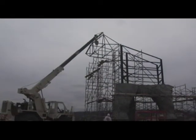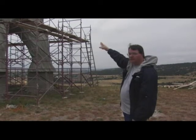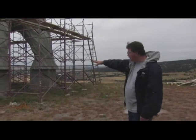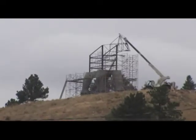What you're looking at right now is the final size of the piece. Inside those legs is a 27-inch square concrete column with steel reinforcement rod that goes down through four-foot squares and into holes drilled 38 feet down into the hill with rebar and concrete to anchor it, because we do have very high winds up here and that keeps it stable.